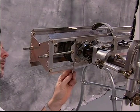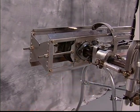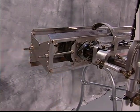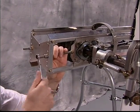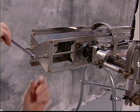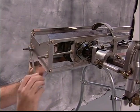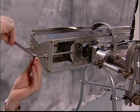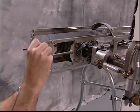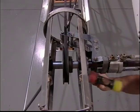To tension the belts, first loosen the rear 1/4-inch bolts on the tail rotor shaft bearing flanges. Then back off the 5/16-inch jam nuts. Turn the 5/16-inch nuts on the all-thread rods clockwise to tighten the belts. Keep the tail rotor shaft perpendicular to the aircraft center line by turning the nuts equally. Rotate the tail rotor shaft while tapping on the self-aligning bearing flanges.